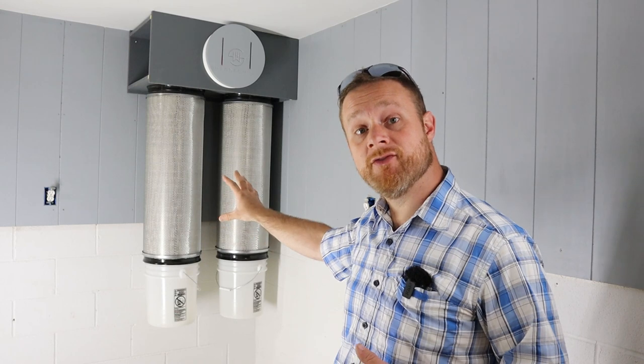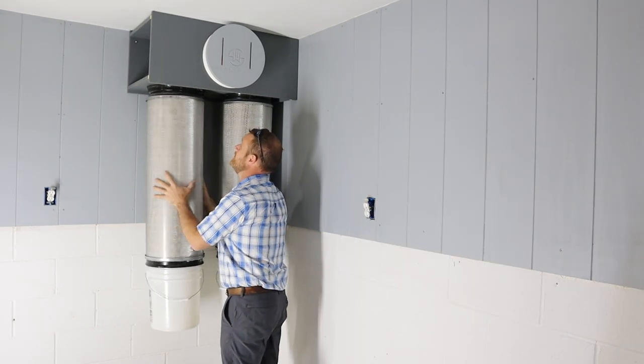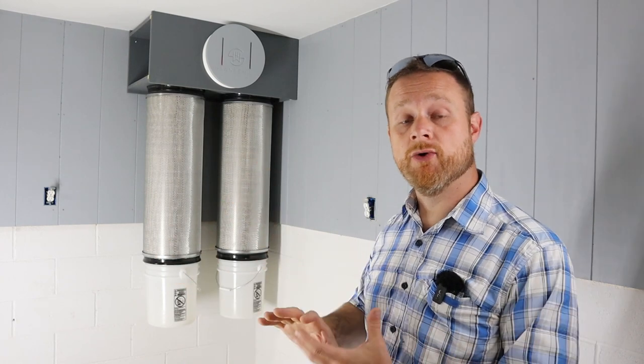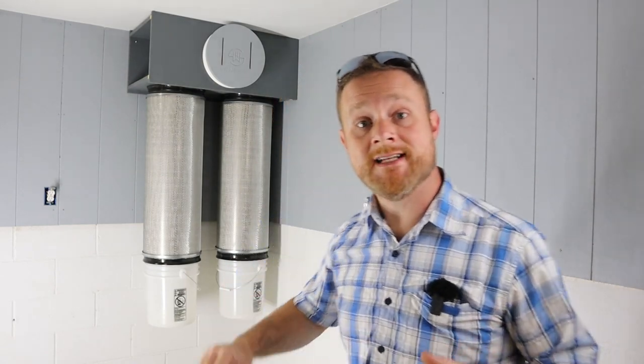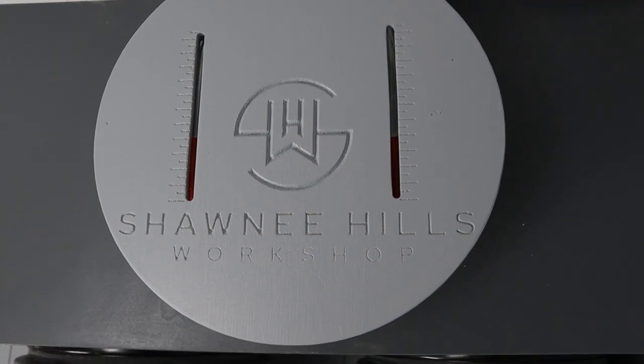There are three new things I'm going to be introducing today. One is easily removable filters — especially good if your filters are in a tight spot or you'd rather take them outside and blow them off. The second is an inspection port for your plenum box, so if you need to get in there and adjust something, you can. And the last is an easy DIY manometer. I've upgraded mine a bit and I'll show you that in the video as well, so if you want to take it to the next level, you can.